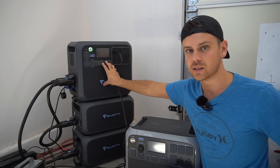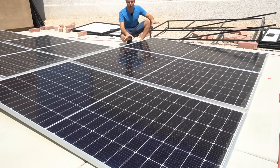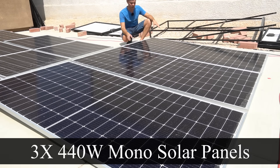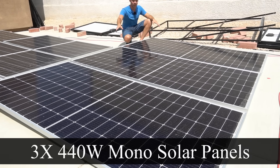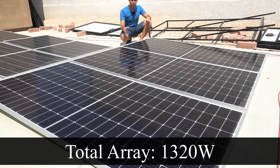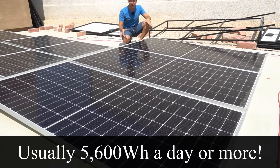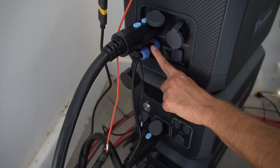I've been overpaneling this system for over a month, so let me show you the solar array connected to it. This micro solar array has three 440-watt panels in series — 1,320 watts total — even though the max input is 900 watts. The Bluetti limits the input current without exceeding the max input voltage. This little array cranks out serious power: we get 900 watts for about six hours a day.